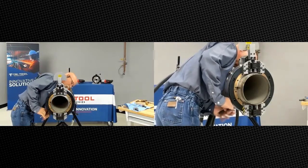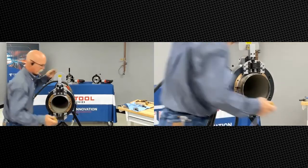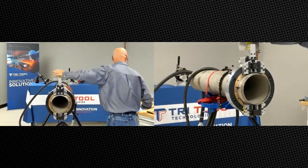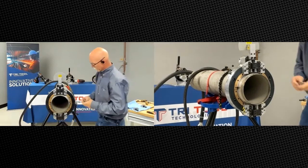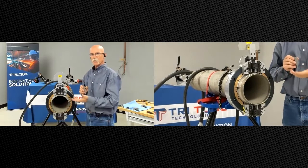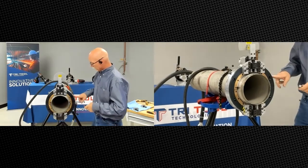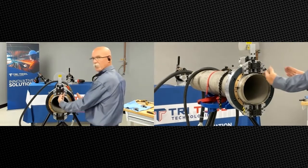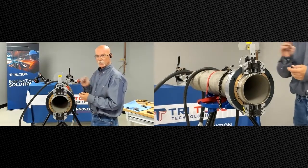When we go to set our tooling in here, we can straight sever, sever with a right-hand bevel toward the machine, left-hand bevel, or sever and bevel both sides at the same time. There should always be a sticker indicating the rotation direction of the machine, but if you're looking at the front of it, it turns clockwise, and you want to make sure that your tool bit's cutting edge is facing that direction.